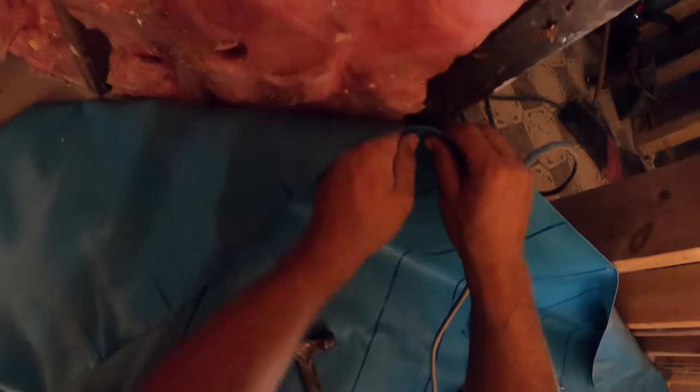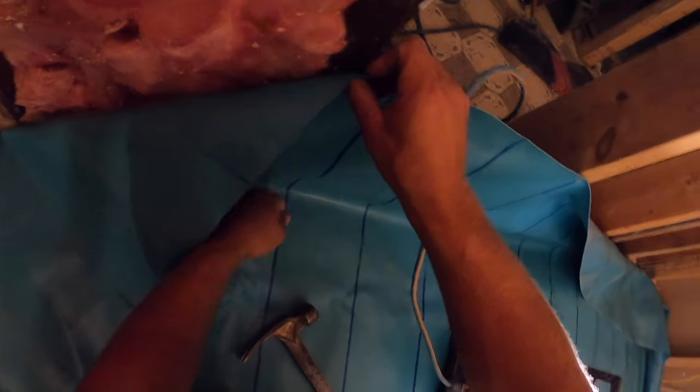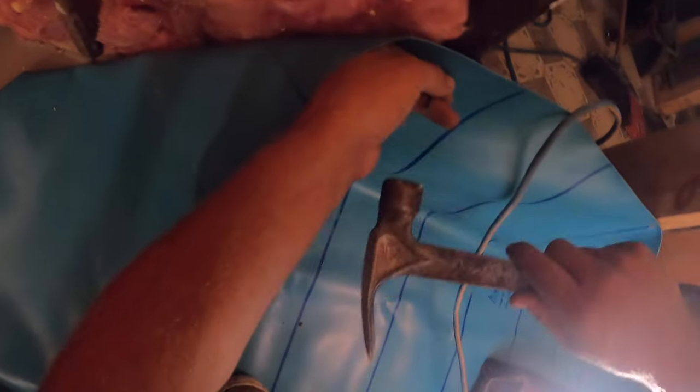What you don't want is when you're packing this mud to be sticking up. So when you're putting pressure down on the weight of the pan, it's just picking the mud up and down. And then what that'll do is end up cracking your shower pan. You don't want that. So you'll make sure there's plenty of room down here before you tack it up.